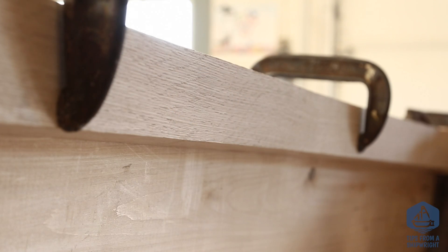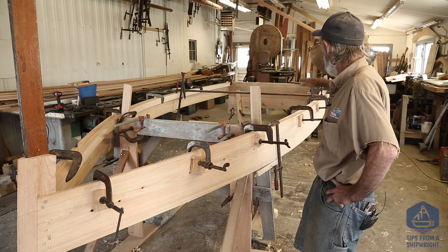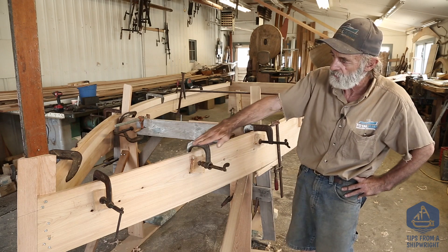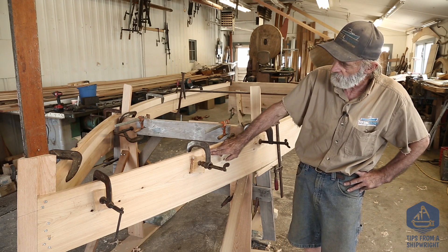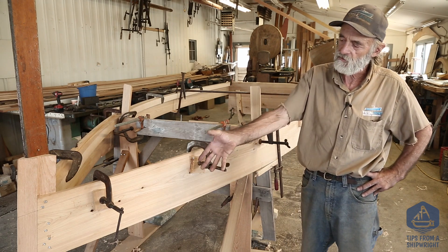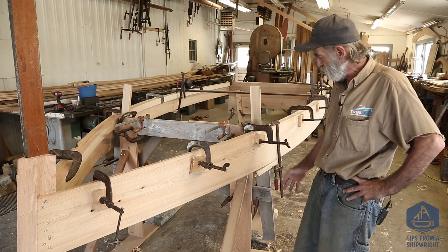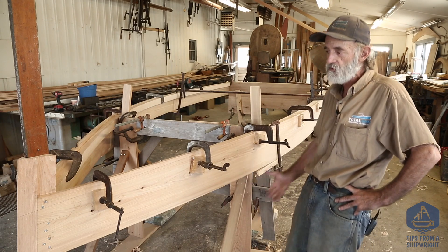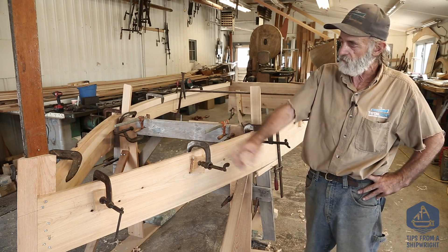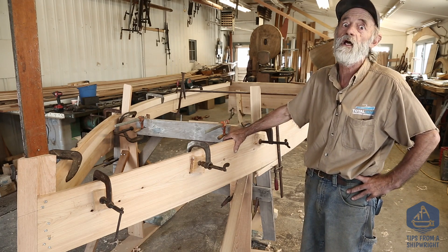The chine logs have relaxed quite a bit with a little time, and you can see that from here aft the boat is perfectly flat — just like we said it was going to be as a flat-bottomed boat. From here forward, we're going to have a little rise, and we'll cut this material off right here, but not right away. The reason I left it on is to keep the plank as wide as possible where it adjoins the stem for stability. We won't cut that off until we add another side plank — then we'll remove the bottom screws, add a couple more above, saw this off, and you'll really get a good look at the profile of the boat at the chine.